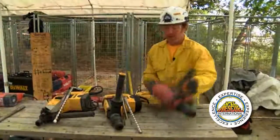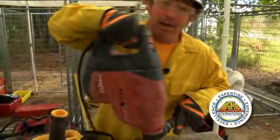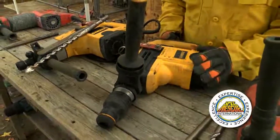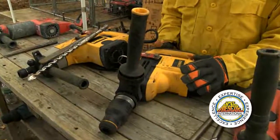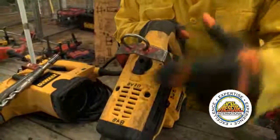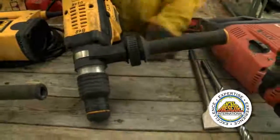As with any of these tools, most of them also have an internal on-off switch. So unless you are actually applying force, you won't actually get the hammer function. Next I'll go over to a little bit smaller hammer drill — this is the DeWalt, and it's also very effective depending on your application. Just like the Hilti, there's an on-off switch back here, a selector switch up here, and it's got the same hammer drill or chipper-only function. You also have the ability to adjust the handle and move it into the position you need.